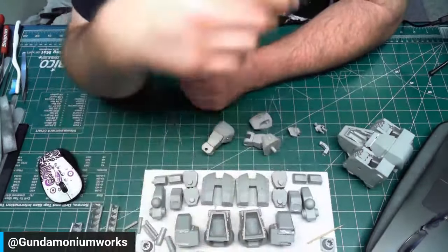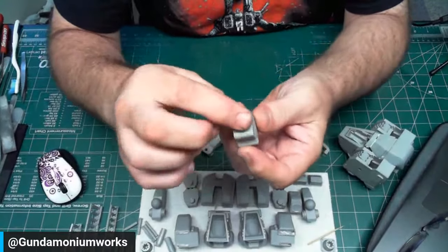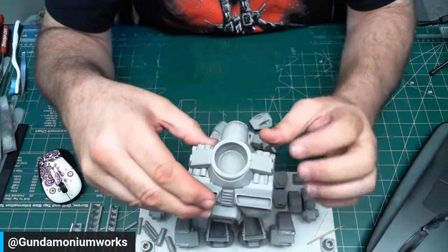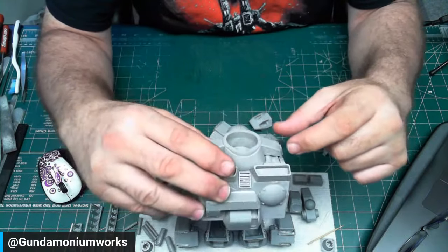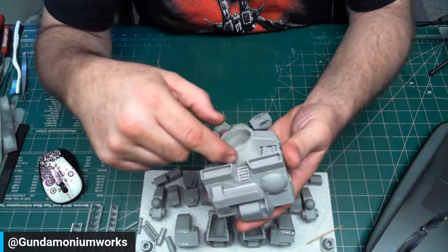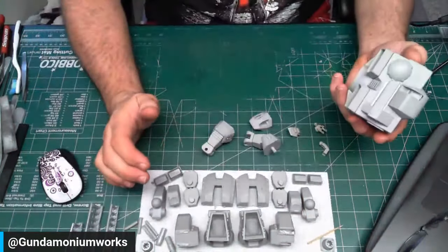So if I do have any complaints, it's that some of the molds, the way they were poured, are inconsistent. Like you can see, this is one of the leg portions here, and this is where everything was poured in. There's enough here on top that can be removed and sanded smooth and be perfect. But one of these sections, in fact this side, this is where those guns and stuff will mount later facing forward in these holes here, there was barely enough resin poured to fit in here without a gap. When I sanded it smooth, there was really nothing left for error there. I also had to do some modifications to these to get them to fit around this circular geometry here, because they would not line up with the body lines without doing that. So I've had to do some little things here and there, but I kind of expected that.